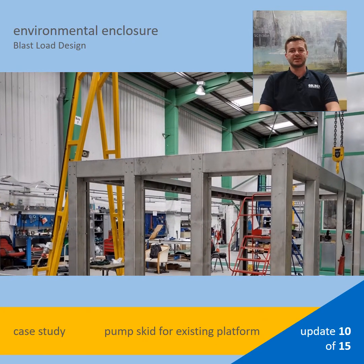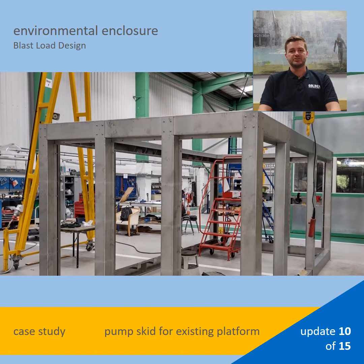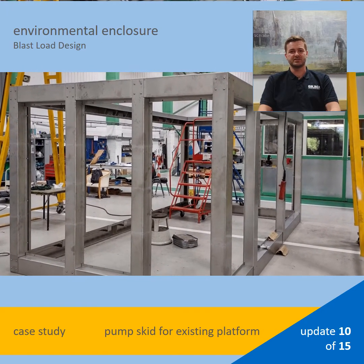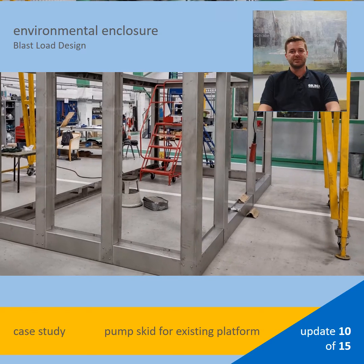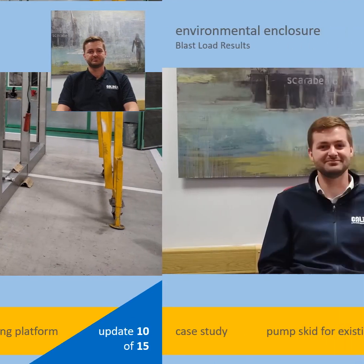The unit needs to be designed to withstand blast loads. Particular emphasis is needed for the environmental enclosure. Should a blast event occur, the structure of the enclosure needs to ensure that no part can become a projectile. This was the second time ANSYS Mechanical was used on this project. Once the complete enclosure was modelled, the specified blast load was applied. The results of the analysis were checked for any excessive deformations and failures. Some minor modifications were required and these were checked with further analysis. Several iterations of this process were carried out and the results of the study were fed back to the design team to be implemented.